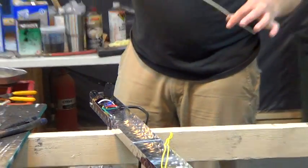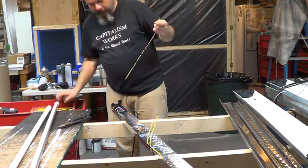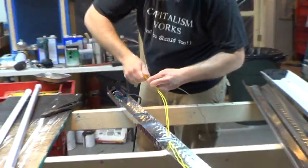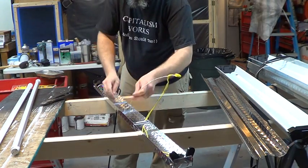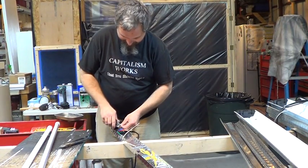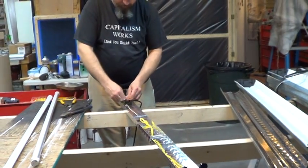The only part you're gonna need is a little bit of Romex wire, because usually the ballast wires aren't long enough — they were wired on both sides of the ballast so you took four inches out. So we're going to make this the neutral, just put it in the jumper. Per code, supposedly when you use a wire nut you're supposed to put black tape around it. So this end with the yellow colored wire, we're just going to get the neutral. The fixtures are already grounded.